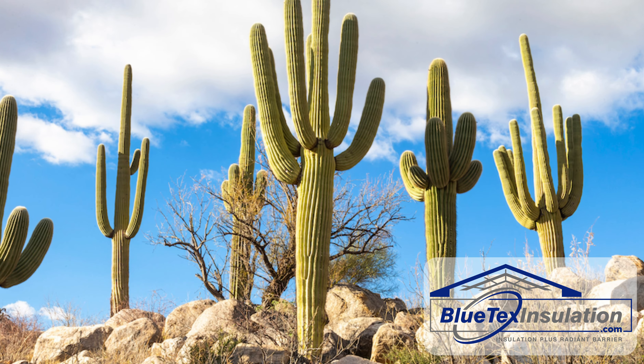This typically happens in 5 to 15 years depending on your climate area and the use of the building. Let's talk about durability. Most bubble foil products can easily be torn or punctured since they have no reinforcing materials. And bubble foil products typically offer no UV or ultraviolet light protection — adding UV protection drives up the cost. Over time, even the UV light given off by interior lights will cause the bubble foil to degrade and fall apart.